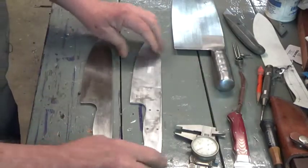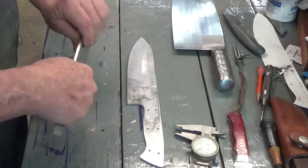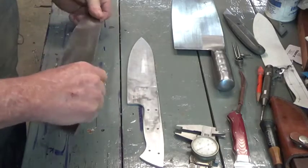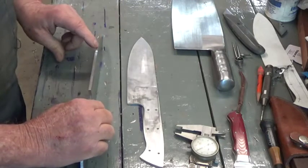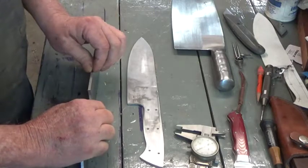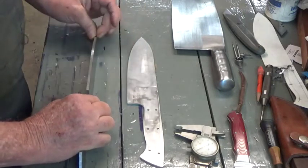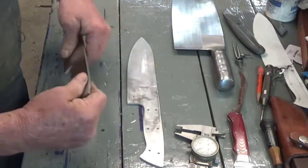One of the things I'm taking into consideration is the handle geometry. I want the handle to have a nice flat so the user can grip it and that twisting motion is somewhat eliminated. When we strike our twin lines on this for the cutting edge, those lines are only going to be 30 thousandths apart, so our cutting edge starting from back here as we bevel in is going to end up being about 30 thousandths thick. The knife is going to lose a lot of weight from here forward.